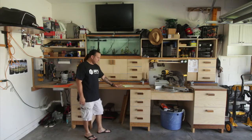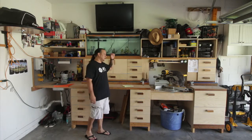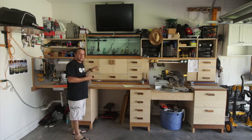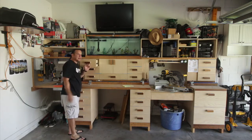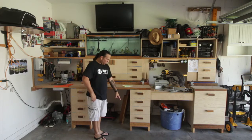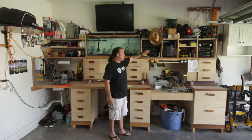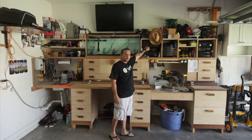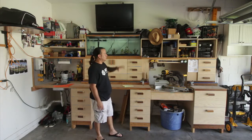From the very floor to the top of this countertop is 36 and a half inches. From the very floor to this section is 5 feet in length. I went with that because I'm 5'10", and when I open that top drawer I wanted to make sure I could easily see in there and grab anything without needing a stepladder. From the floor to the top of this cubby is 6 and a half feet — same rule applies, I wanted it easily accessible. Anything above that I consider long-term storage, for stuff I use maybe once a year, so a stepladder is fine in that case.